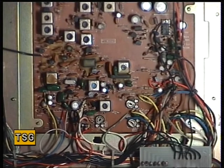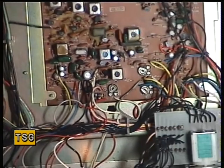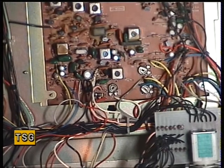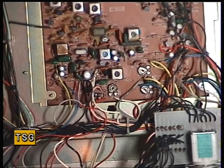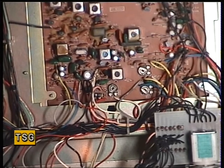Now we'll see what the sensitivity is like. Not too bad, considering what the set is. Just for the reading, I'll tell you how many decibels — that's 0.3 for 10 decibels SINAD. That's not that bad. That's tone high, incidentally — tone low.